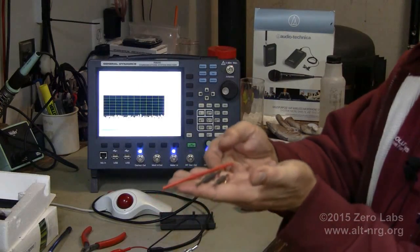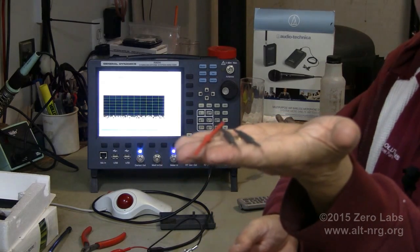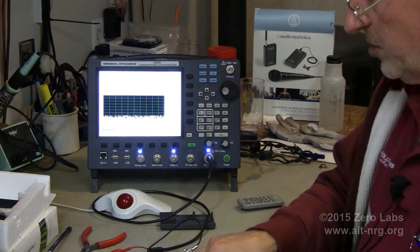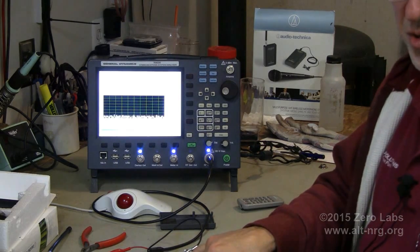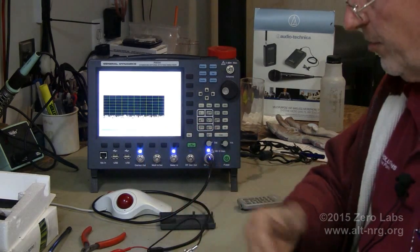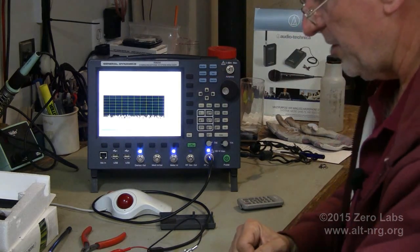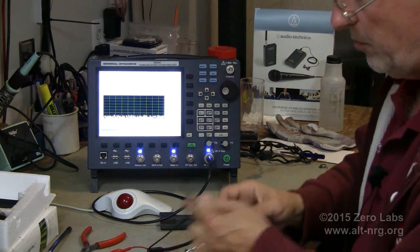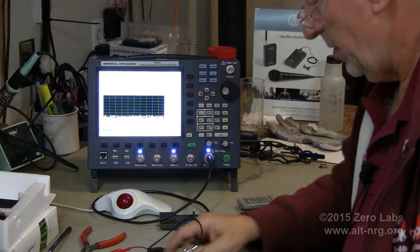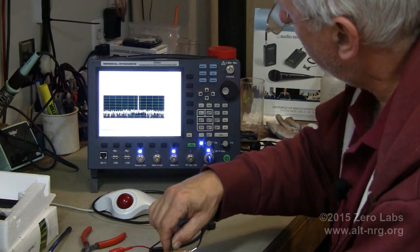We've got a small assortment of non-ferrous alignment tools that I can insert into the adjustments for each of these. Now, these transmitters are crystal controlled, but the crystals can be pulled slightly above or below their center frequency by tuning the oscillator tank circuits that they're associated with. And that is what we're going to try here. Oh, there we go. Look at that.